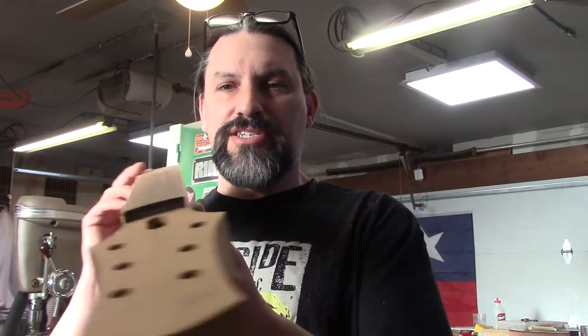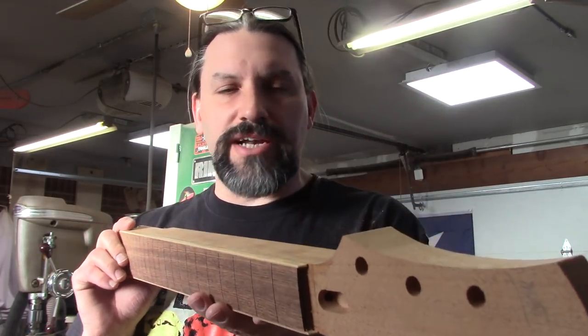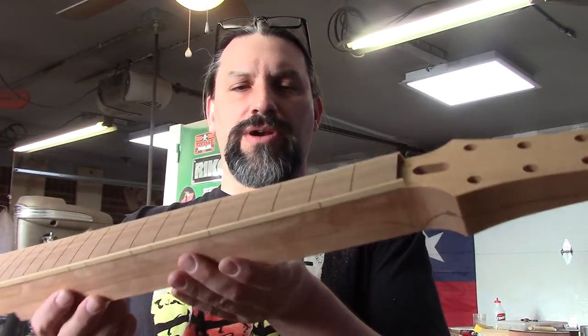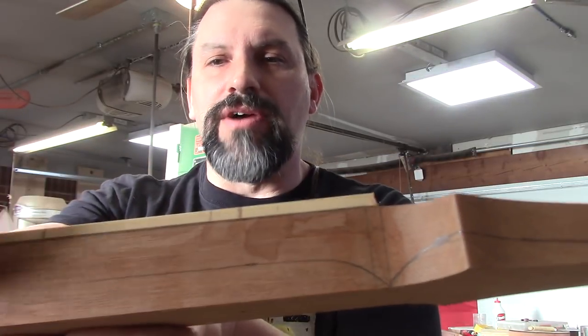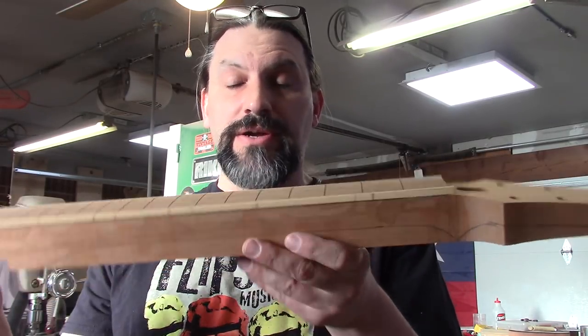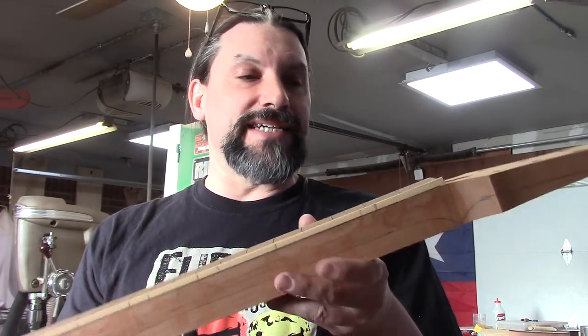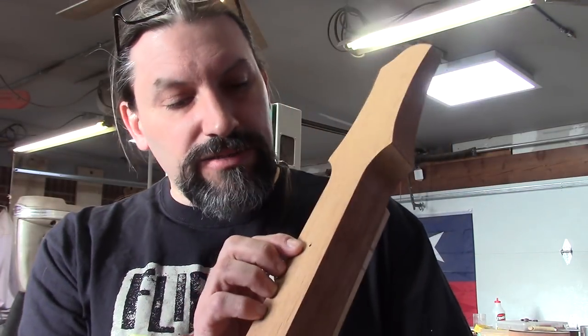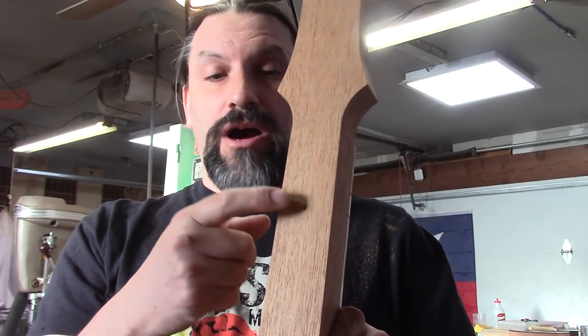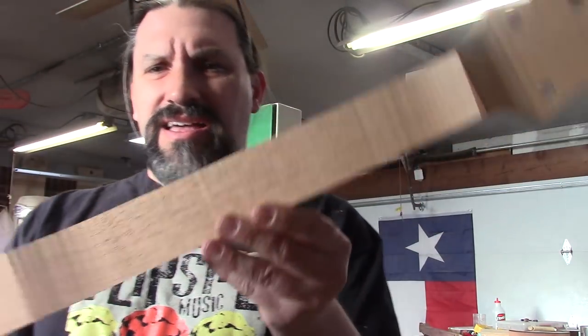We're working on a series of videos. In this video we're going to be taking these Challenger necks — the double cutaway guitar necks, one of which is for Cheddar Kung Pao — and we're going to take them from this step. The last thing we did was put radiuses on the fretboard. We're going to rough cut out all of the material that is not neck material. First thing we're gonna do is cut all this meat away with the band saw. One thing to pay close attention to: these holes where we screwed the guitar neck to our radius jig are going to get cut away.